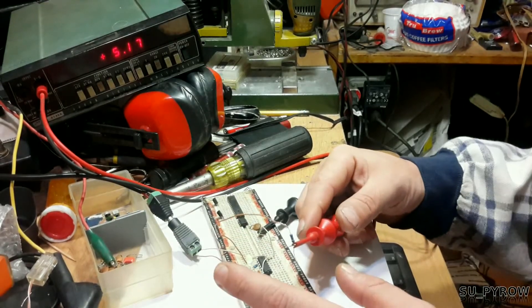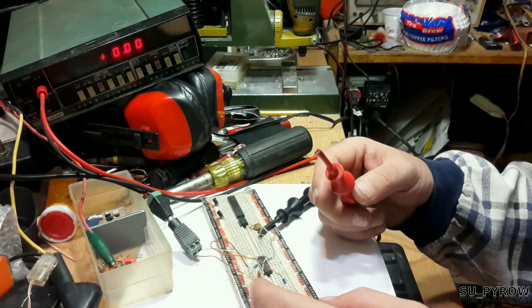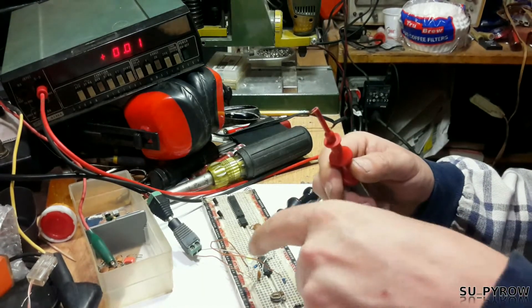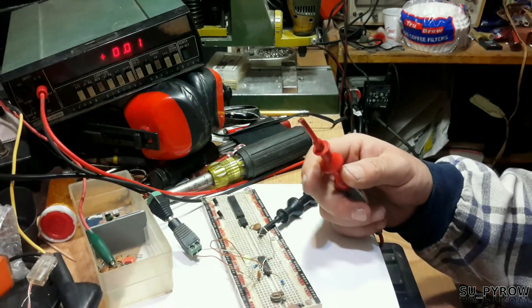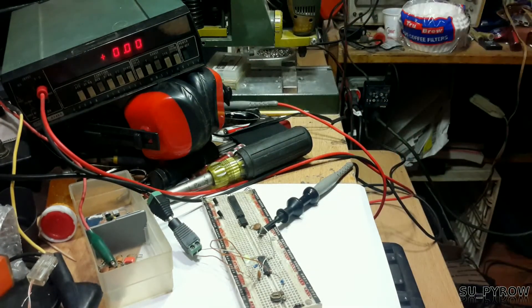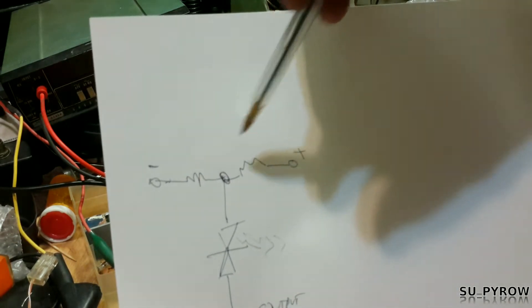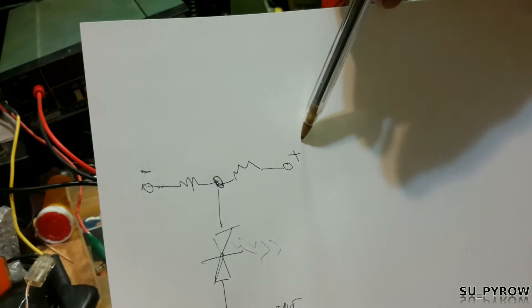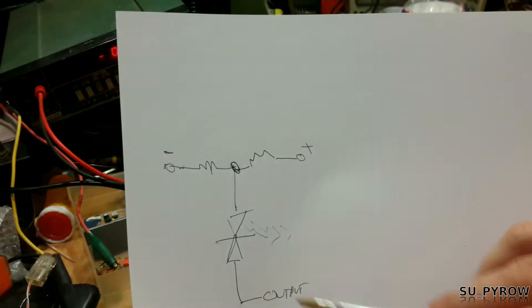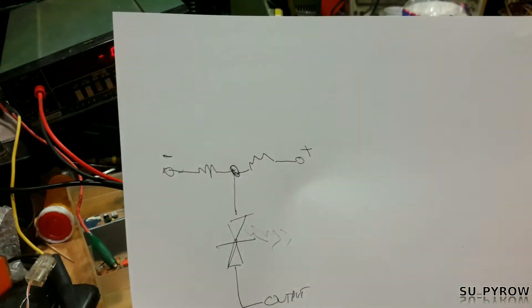Now that we've got that done, let's set it up on the bench and do the oscilloscope thing. I'll make a circuit — two current limiting resistors, 1k for five volts. One goes to one rail, the other goes to the other rail. Because it's a bi-color LED, the output will either go high or low and pass current whichever way it needs to.